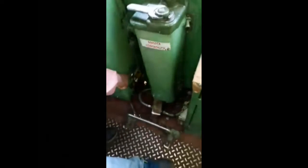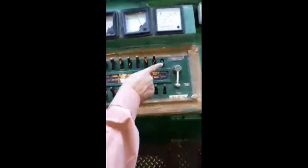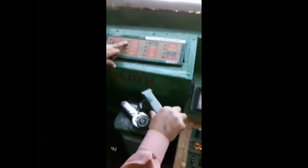We can memorize these four points using the mnemonic 'MBBS': M for master controller MCB, B for BIVS, B for BL key, and S for control switch. Now taking a notch, the master controller lamp lights up and extinguishes — the fault is resolved.